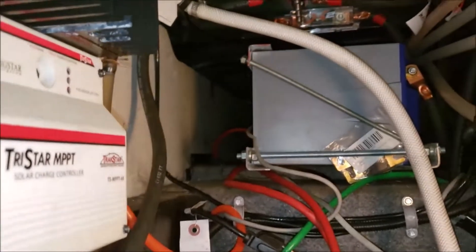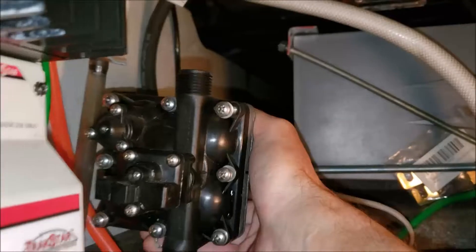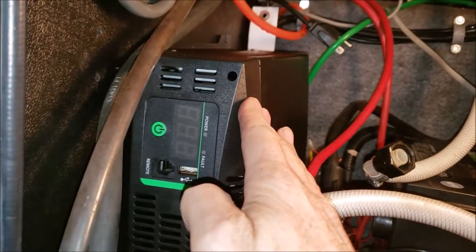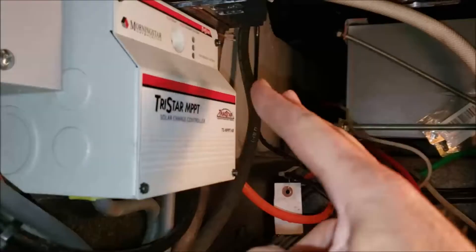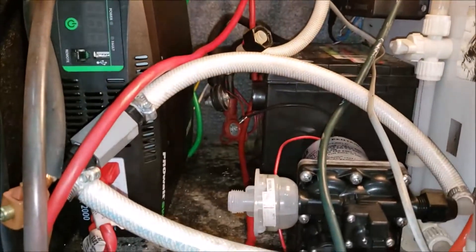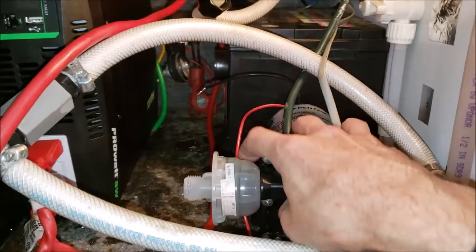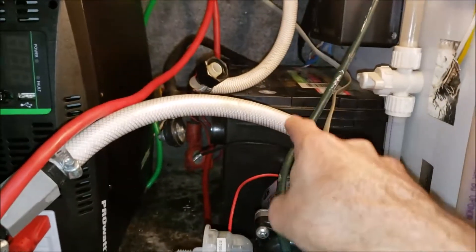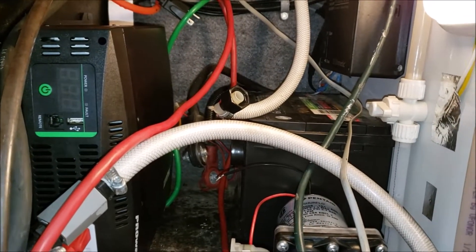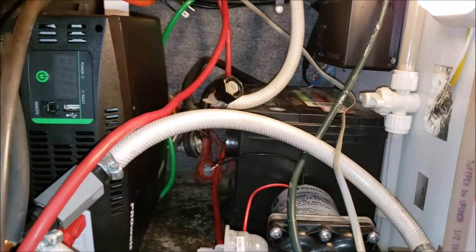In the original configuration I had the water pump parked right here, which gave me more floor space. But now that I've got the larger Xantrex inverter, my best configuration is to mount it up against this wall — and I don't want my water pump above it, because water and inverters don't mix. So I'm reconfiguring everything. I'm going to reposition the water pump down here, which is actually where it was originally from the factory. Years ago when I upgraded my battery bank I put in four six-volt batteries and moved the engine starting battery to this location.